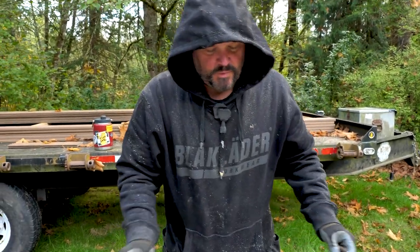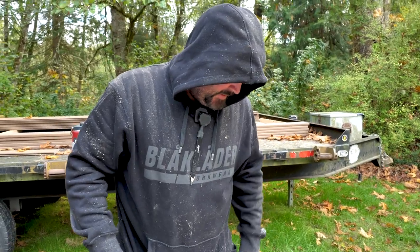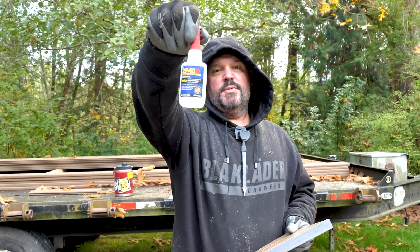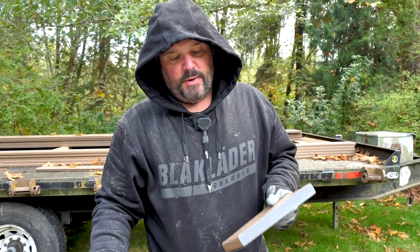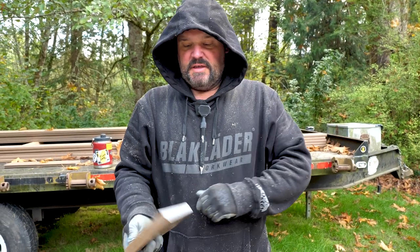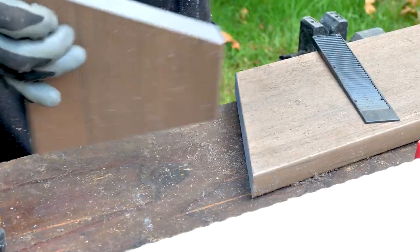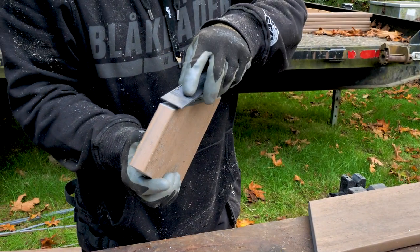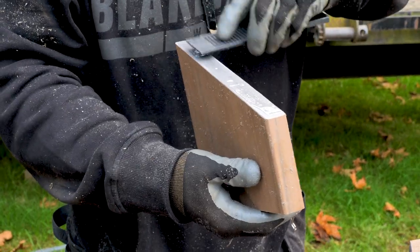I'm making a trim piece for the other side of the staircase. Yesterday I was having a hard time figuring out how to build it, but we got it figured out now and I like the way it's looking. I have these two parts and some 2P10 superglue — it's made for PVC. 2P10 stands for two parts, ten seconds. When I glue this together and hold the PVC joint for 10 seconds, it will be bonded. It's made by a company called FastCap — not sponsored. They don't work with influencers is what they told me. I'm going to put a nice even light coat, enough to bond these two pieces of PVC together.